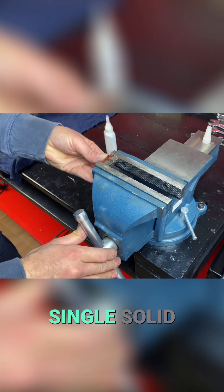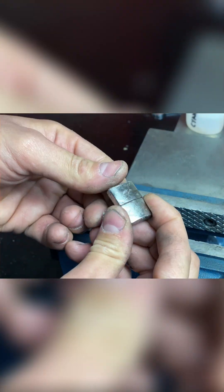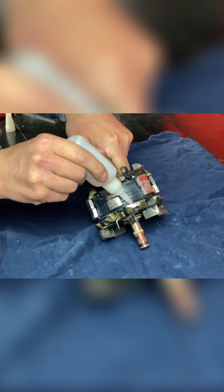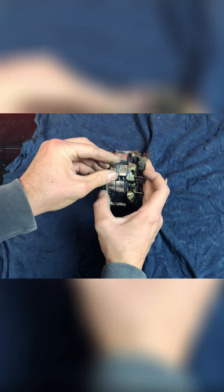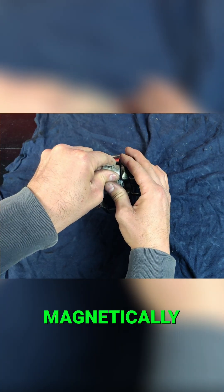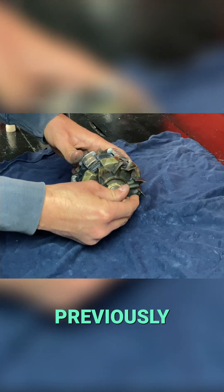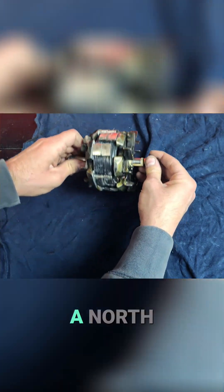This way we can insert them as a single solid magnet. We'll join six pairs of magnets together. And now we begin gluing them on the opposite sides. These magnets are magnetically oriented with the opposite polarity to the ones we glued previously. If the previous row of magnets had a south polarity, these will have a north polarity.